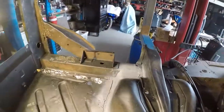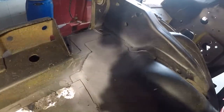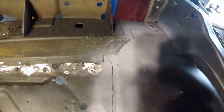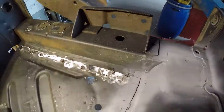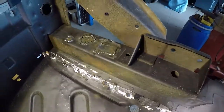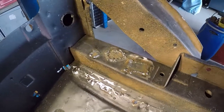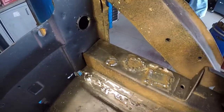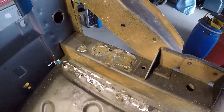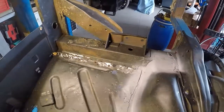What we've done this morning is we've got rid of that rust hole that was through the strut tower. This is on the left-hand side, driver's side of a left-hand drive car. We've also fixed up a bit along the side here, and there were a couple of rust holes in the chassis which I've actually taken right out to hard metal and replaced. So I'll give that a coat of paint and then that'll be alright. We're progressing nicely.